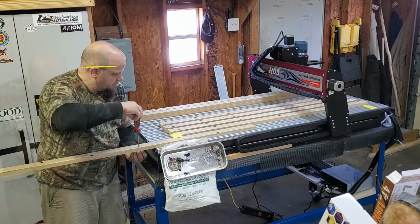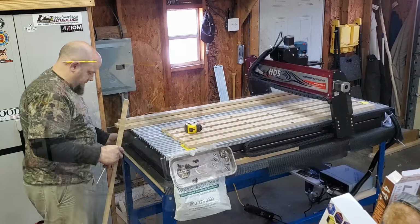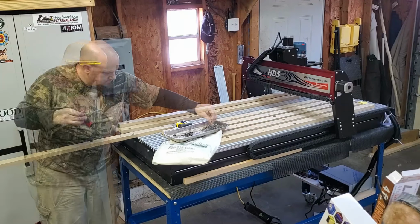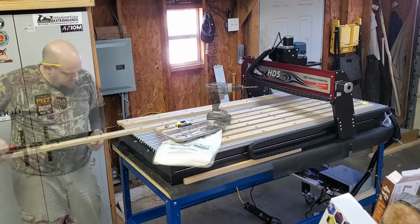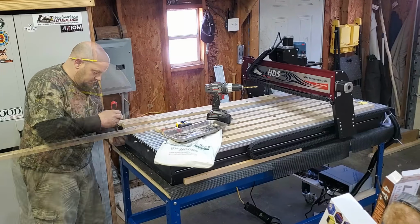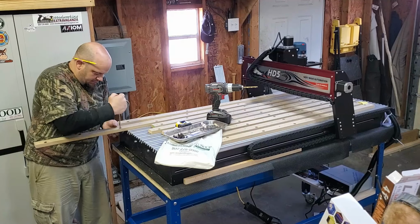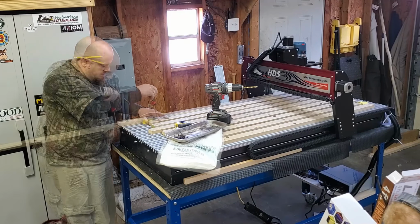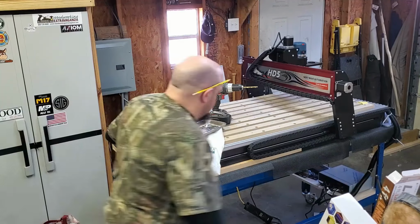And now what I did for my math here was I figured out, using the router, I went all the way around the perimeter to see what my cutting perimeters were. Then I added about a 1/2 inch all the way around, because a 1/2 inch essentially is going to give me more than enough with a spoil board bit to clean those off straight. So that's kind of what I did. It ended up with a pretty nice little work surface.